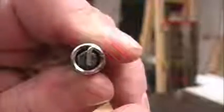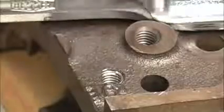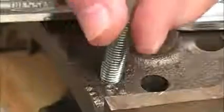Remember that little notch next to the tang? Well, that's how we get rid of the tang if we have a through bolt or we need to stack the inserts for a long threaded hole. I just set a good size hex key down a hole, set it on the tang, wrap it with the hammer, and it's gone. After knocking off that tang, we can thread one bolt through one insert or stack inserts in a deep hole to really grab a long bolt.